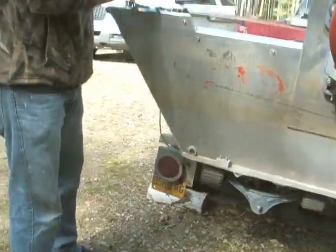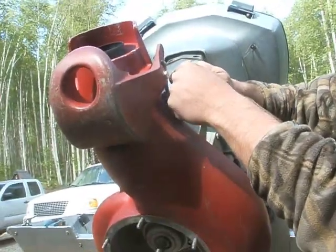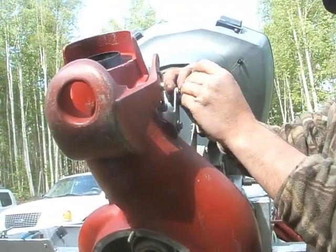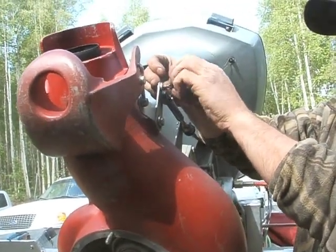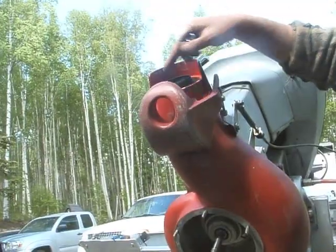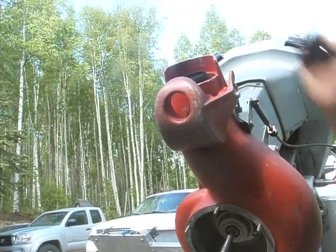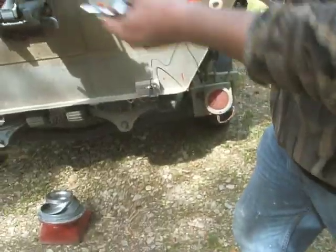I always just kind of put these right back on after I do this so I don't lose them. The shaft's always spinning — the shaft and the collar are always spinning. All this does is direct the waterway out. Try to keep it so you're not pushing forward too far, or engaging with the bucket and the reverse. So the water hits this and blows it back the other way — right there. To get the inside ones out.